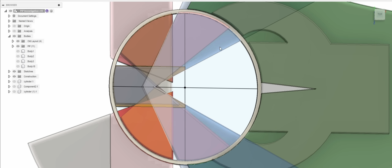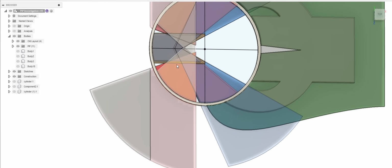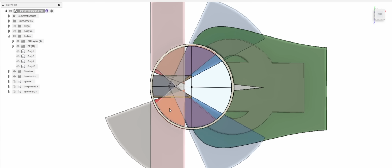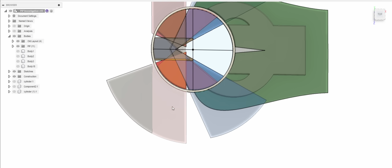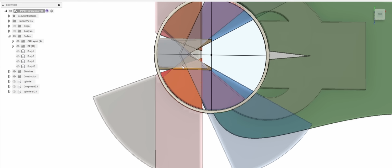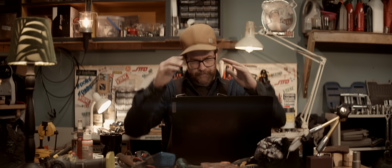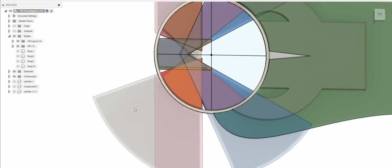And you can see there's not much difference between these two ports, except for the width there. And same thing goes for the B transfers. But here I screwed up, because I made the B transfers wider. And you can't see the rest of these ports, but they're pretty much shaped like these ones. And there's a hook here. My reasoning was I wanted to delete the hook and retain the same angle all the way, so that the mixture wouldn't have to bend in more than one plane. Could produce more power. Other people's testing seems to have shown that the hooks are necessary. I've deleted that, and there are hooks in there now.